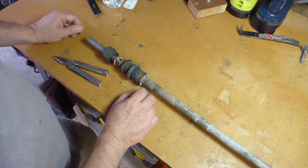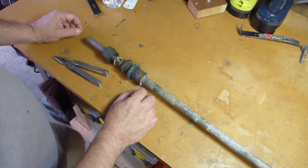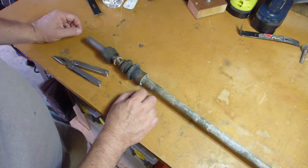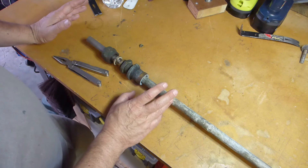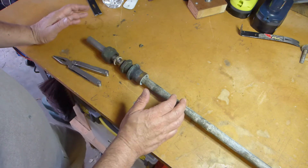What you need to be doing on a periodic basis — like every other time you haul the boat, or at some regular interval, which I don't think was ever done with this boat — is disassemble the stuffing box and pull the shaft out. And here's why.